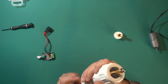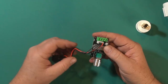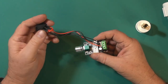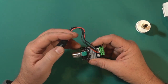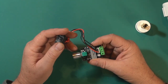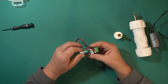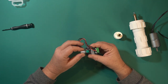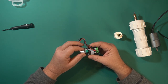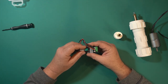The other thing I purchased — and this will be in the description — is a variable rate switch. It comes with the switch. The only thing I'm not really up on is I like a momentary switch, but as long as you don't forget to turn it back to off you're good. This gives you hopefully a finer adjustment if it moves too fast. I can't find the 2 RPM motors anymore — this is a 5 RPM motor, so it's just a little bit faster. Before I was running it off a 9-volt battery.